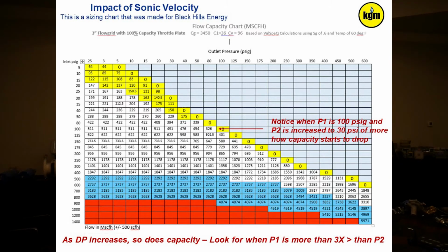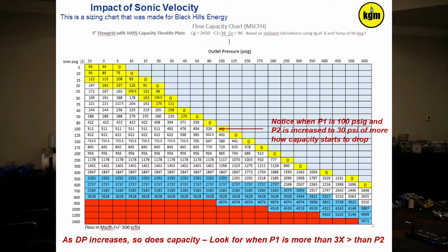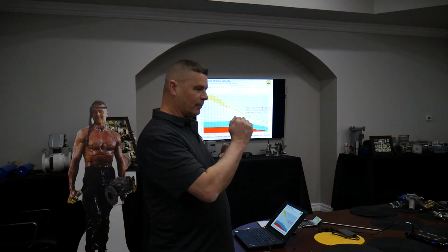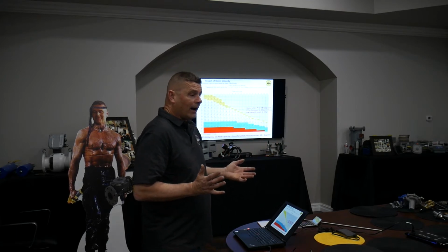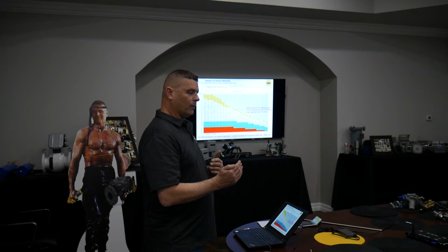Jeff Good was mentioning something that I should bring up now. We never spec a valve and sell it to the customer based on it doing 100% of what they need at its maximum conditions. Why? Because we need a certain amount of safety margin for the things that we don't know.